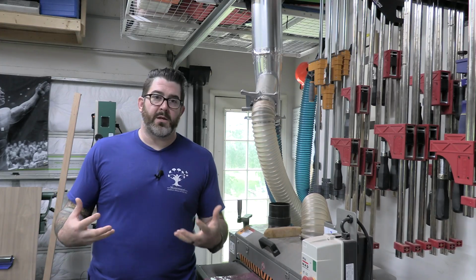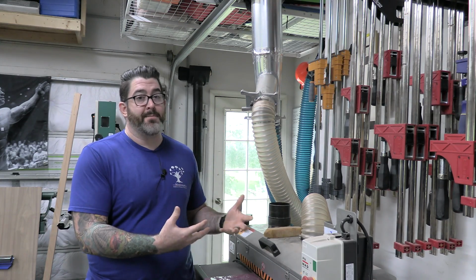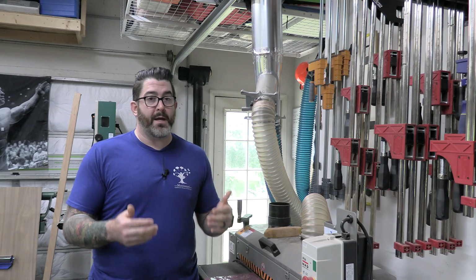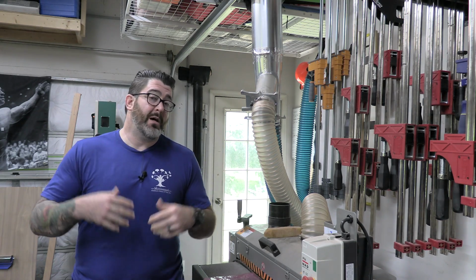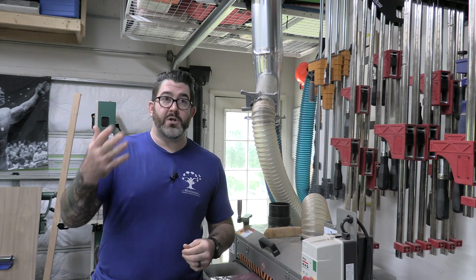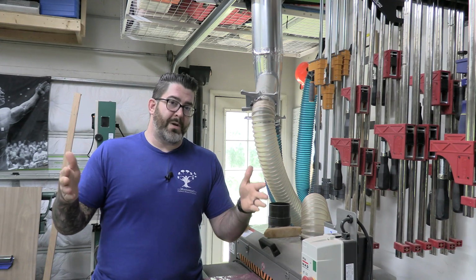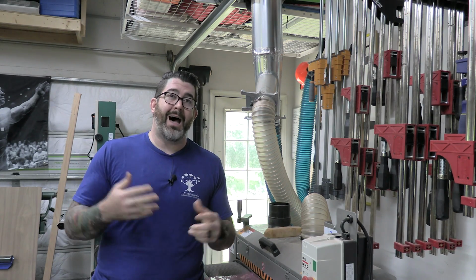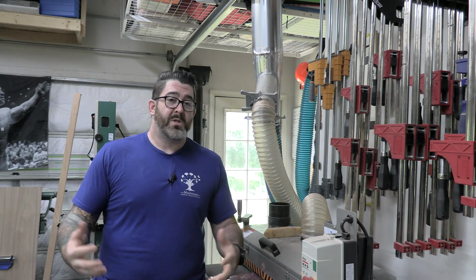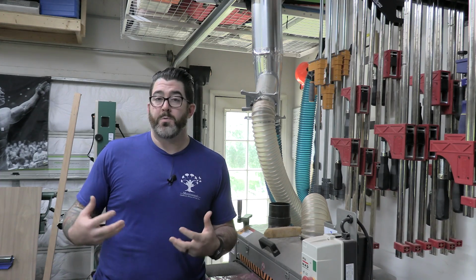You'd have to call and double check, but having a professional design this is a big deal, and I can't stress this enough. There are so many things that go into making a dust collection system work at its best. For instance, we've mentioned a couple times a 90-degree elbow. You do not want a straight 90-degree elbow coming off of something. What you ultimately want is a gradual 90 if you have to do it. We also have issues like in this shop, when we started talking about the distance that I had to make the initial run. You want the longest straight run coming out of the dust collector that you can. I knew I wasn't gonna be able to have a super long one, so having a professional who could help me model something that was gonna provide ideal efficiency in my setting was well worth the money.